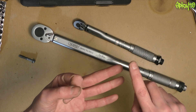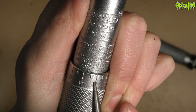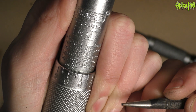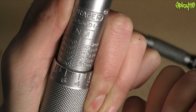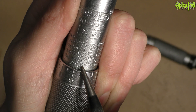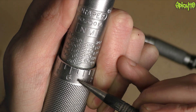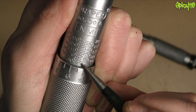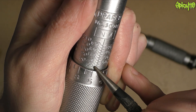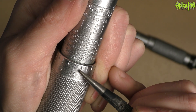That covers what they are, why you want one, and the sort of scales you're going to be using. Now the question is: how do you set a torque wrench? You'll notice here we've got a scale with all our numbers on either side — newton meters. Make sure you get this the right way around. Let's say we wanted 62 newton meters. Each number has got a line that goes along, comes down, and diagonals. The bottom of that line is the point that it is that number. You don't want it underneath this one — that's a false reading. This is the case with this torque wrench and my other one. It may be different with other ones, so read your instructions. On this one it is the bottom line. So we're going to go for 62 newton meters — it goes 30, 40, 50, 60 — so what we need to do is get this up to that bottom line.